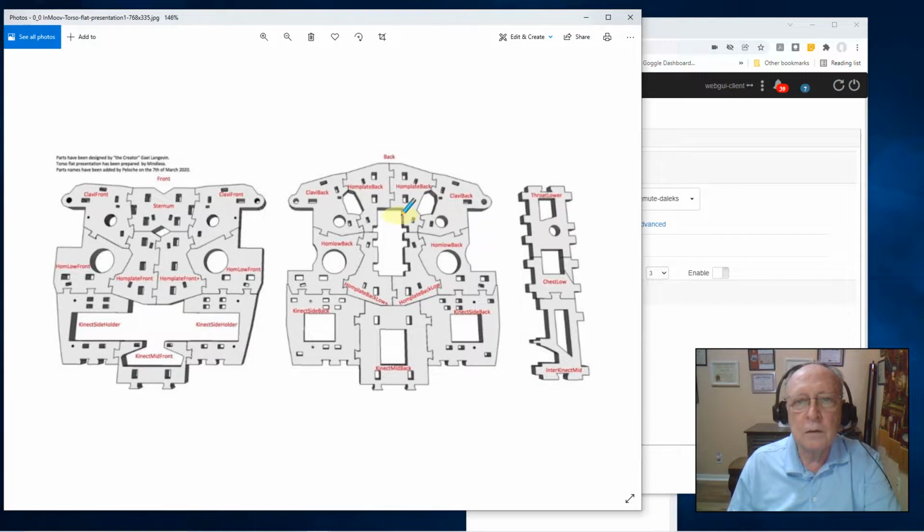So I'll tack weld the back pieces together. I'll tack weld the front pieces together. These two assemblies, I'll probably tack weld this right here so that it stays together. Again, I'm not going to tack weld here because this piece is removable for servicing a servo. Set those in place and sandwich the whole unit together.